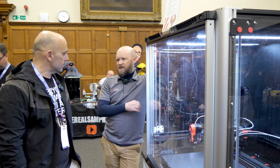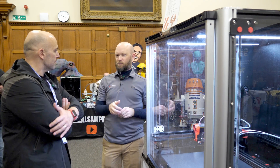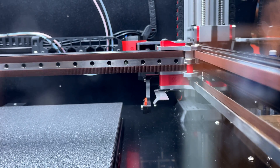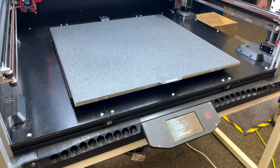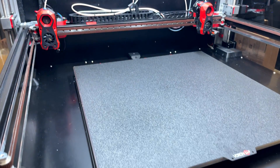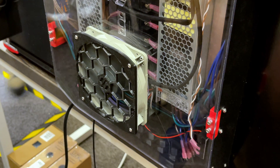This is powered by the new Big Tree Tech Kraken controller board, which was designed in collaboration with the Voron team. They reached out to BTT needing the be-all end-all board for 48 volts running five-amp NEMA 23s — the Octopus Pro Max wasn't enough. The Kraken has eight drivers: four use standard JST XH connectors for NEMA 17s, but the key drivers for the XY motors use separate higher-current capacitors — around 880 microfarads each — with JST VH connectors supporting up to 10 amps of current.